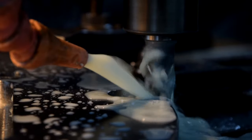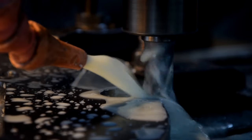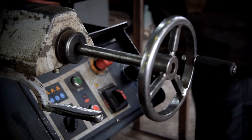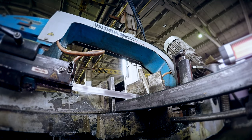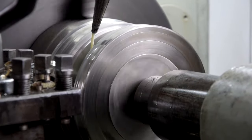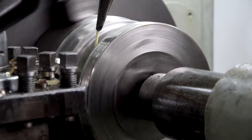Experimental production of cutting oil with the AVS. The cutting oil we made is an ingredient in the preparation of 3-10% emulsion, used in the process of machining alloy, stainless, heat-resistant steels and alloys, in turning, drilling, cutting, reaming, threading, broaching and heavy-duty grinding, as well as aluminum alloy machining.